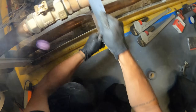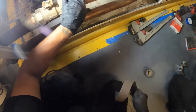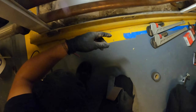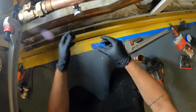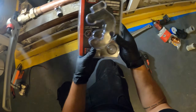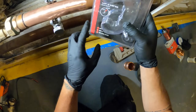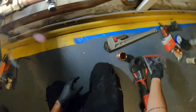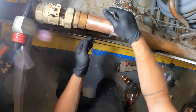Let's prep this and get it sanded down beforehand. I'm going to cut this area, spin this valve off, and put it back. Got this really cool close quarters cutter — this is the Wheeler Rex, model number 4992. It cuts from 1¼ inch to 2⅜. I finished draining, so let's cut this up. Might get a little water.